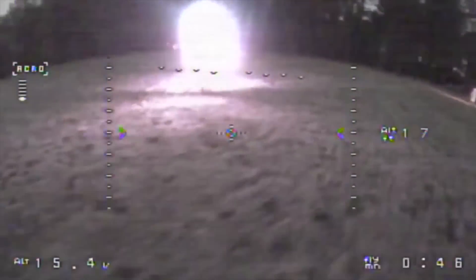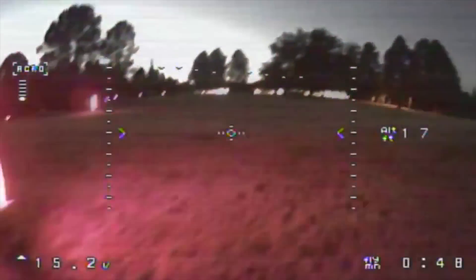There's the base firmware, of course, the standard one that comes on the modules. There's a firmware that Shea Ivy came up with that lets you play Capture the Flag with your LaForge modules, and they even have a really cool spectrum analyzer firmware that does — it's a little bit less user-friendly in terms of just day-to-day use, but it gives you a lot more flexibility. It basically turns your LaForge module into a full-featured spectrum analyzer. You can easily flash them using this app, and if you don't like it, you can just easily flash it back.